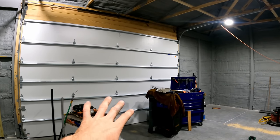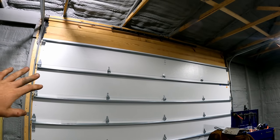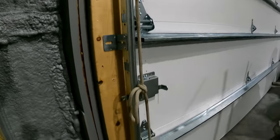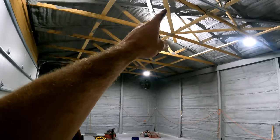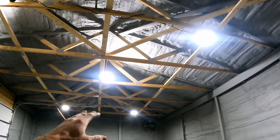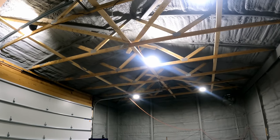I was able to raise the garage door eight inches. I had to unwind the springs — that's a little sketchy if you've ever done it — and I brought the torsion up eight inches along with the rails, extending each side with a cut piece. It came off about another foot and a half, so I got the door up about eight or nine inches total. When we put the car lift in, that door is getting as close as it possibly can to those trusses.